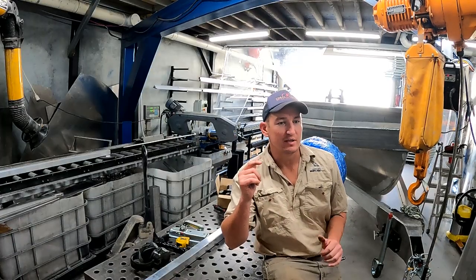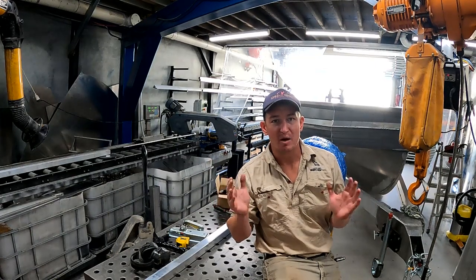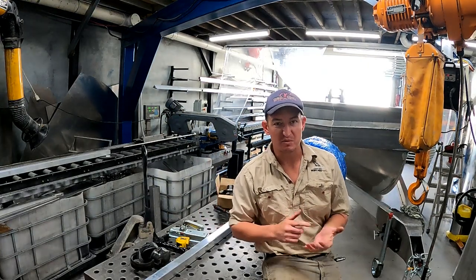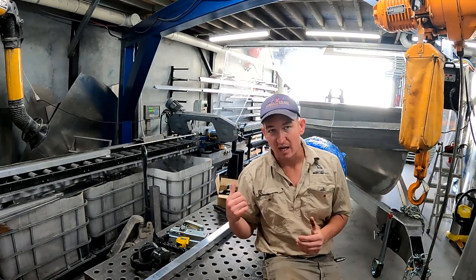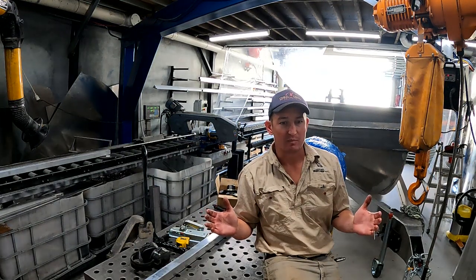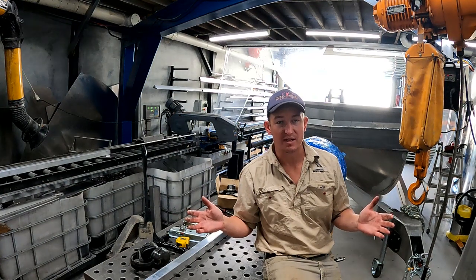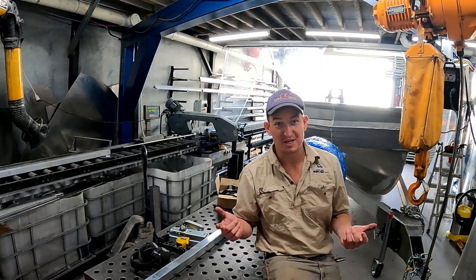Right, one thing I've got to do is make sure the wheels on this trailer are bang on with the quad that I run. I run a 2017 Yamaha Grizzly 700. So I'm going to find some specs online to find out the wheelbase, because I don't have the quad here, it's around the corner. Then I'll set up my stub axles with the main axle that I'm going to bolt them to, line up the wheels and get it fairly accurate, within 10-20 mil, so my wheelbase on the trailer is exactly the same as the quad. You'll see more videos to come. If I stuff that up, it's not going to be the same.